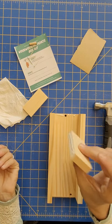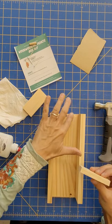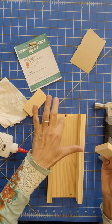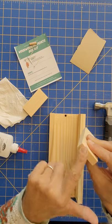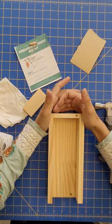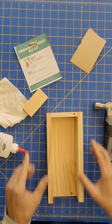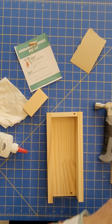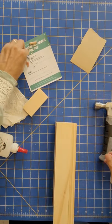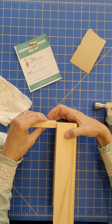I'm gonna put a little bit of glue here and spread out that glue, and spread out this glue. I can do the ends as well — if you have a little extra glue, you can put some glue on your ends. My side was a little bit tight here, so when we get to the other end I'm gonna have to use a little muscle to get them together. I've got this here; I'm gonna put this on its side. I'm gonna use one more nail here. I wanna make sure that I'm in the middle of this piece of wood, because my nail's gonna go through the side and down into here. Since I drilled a hole for my dowel, I wanna go a little bit lower than I normally would.